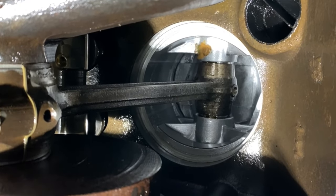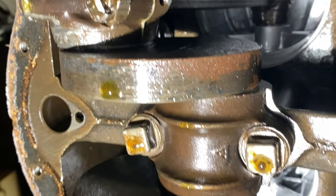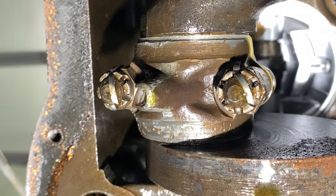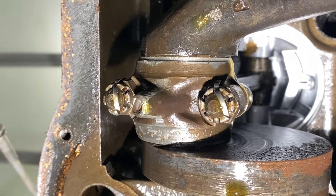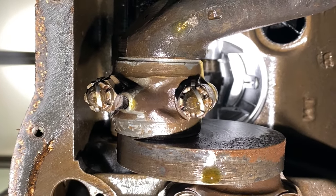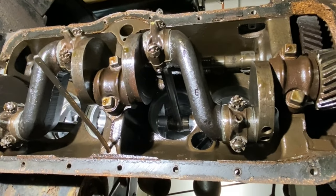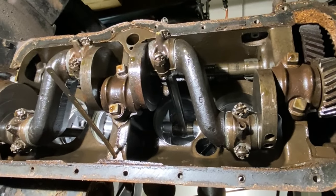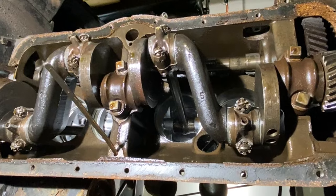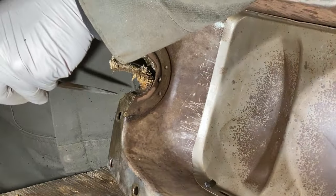The engine doesn't run very smooth — they have quite a bit of vibration. Here's a piston skirt and connecting rod. If you look at the babbitt there — the silvery part — that's the babbitt bearing. That's an alloy that they pour; they actually pour the bearings and then machine them to the right specification. There are no insert bearings on this motor. All the babbitt looks really good from the outside. I didn't take any bearing caps off — I had no reason to believe there was any problem there. I'd already run the engine and it ran smooth; we just had a bad head gasket.